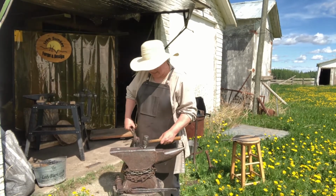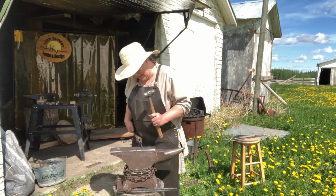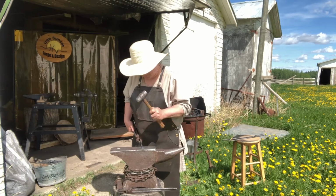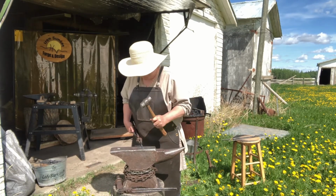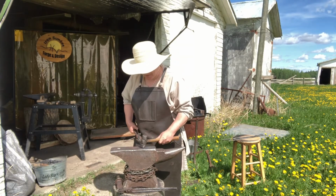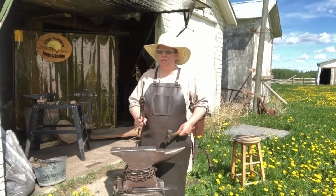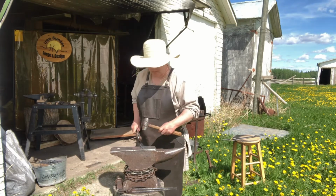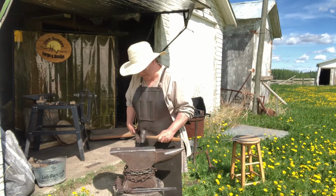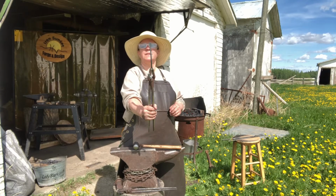So you're going to hold it tight again to your hip. Ergonomics is always good. Shoulders back. And this, you're not having to do too much. You're just flattening it out. So you want to be aware of where the metal is going. If it's going too much on one side this way, flip it around so that that same hammering habit that you have, you're pushing that metal again. So if it's hammering only to one side, then turn it over, hammer it to the other side, and there we go. So squish this to a quarter of the thickness.